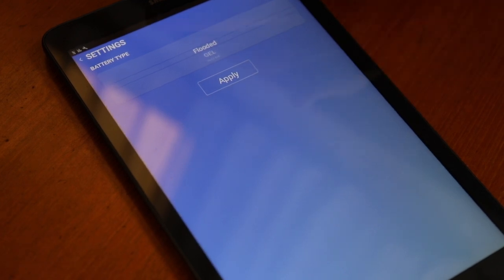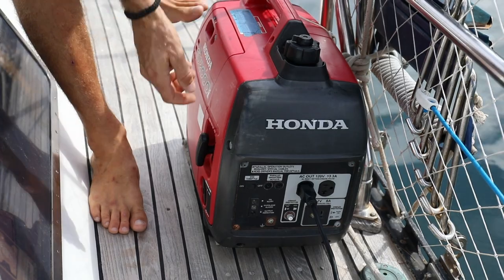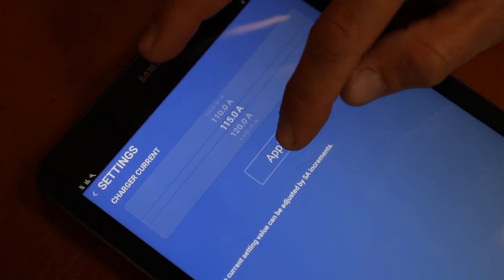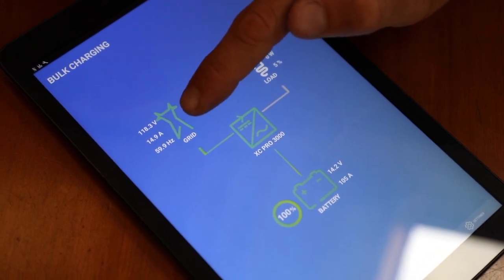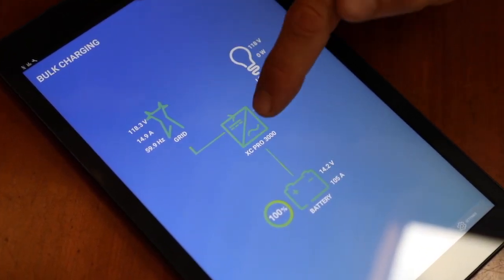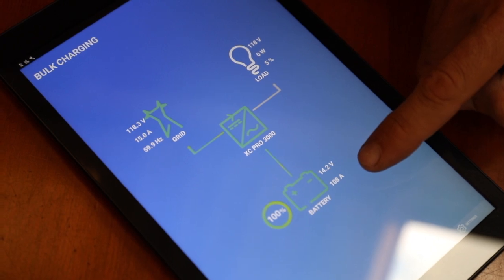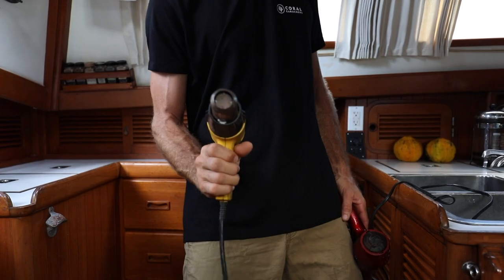With the new inverter installed and the remote panel linked to the tablet, we can go ahead and set our battery type and any other custom features. With the wiring complete, it's time to test the install. Since we're at anchor here in Morea, we're going to use a Honda 2000 to test the charger. Right now we're putting 113 amps into our battery bank, which is pretty incredible — that pretty much maxes out the little Honda. It's putting out 15 amps AC into the XC Pro, and the charger is putting 104 amps into the battery bank. It can do 150 amps for lithium batteries, but the Honda can only put out enough for about 105.